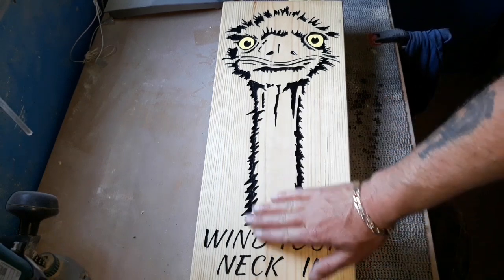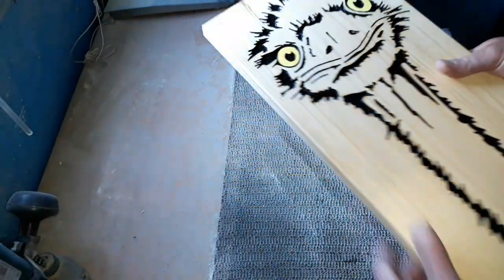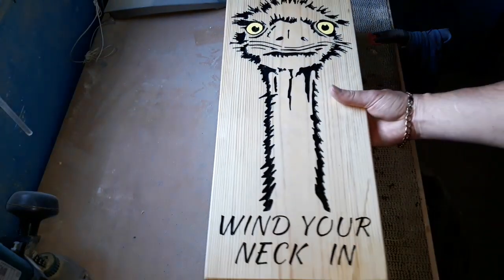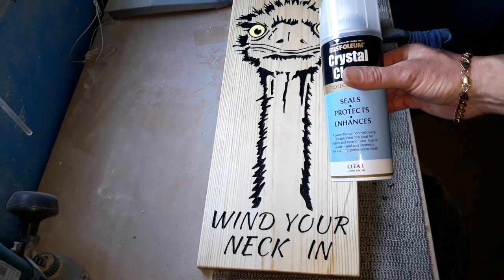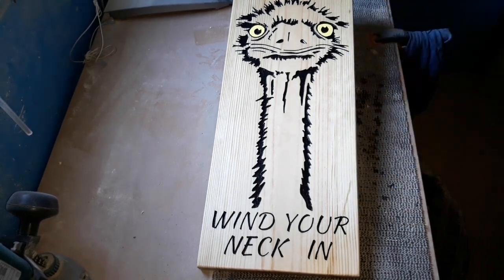That's nicely dried and this project is more or less finished. As always, just a basic slot routed in the back — it's quite deep wood this one so you've got no issues with that. We've got a little bit of shine going on there, and that's literally a case of spraying on the same stuff we used before painting — polyurethane, varnish, anything you're happy with. Get what works for you. So there you have it — 'If you can't say something nice, just wind your neck in.' 20 inch by 8 and a half, routed out. Thank you for watching.